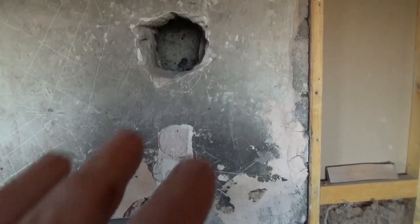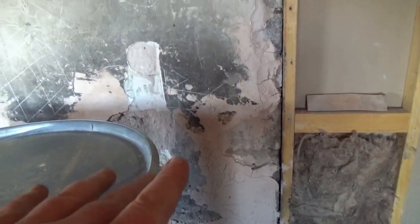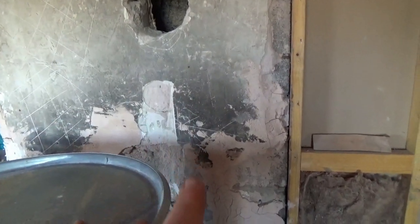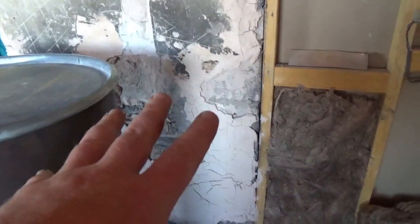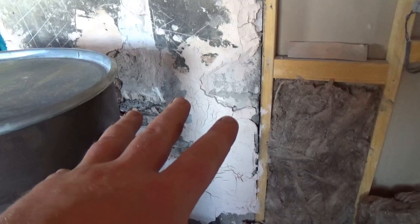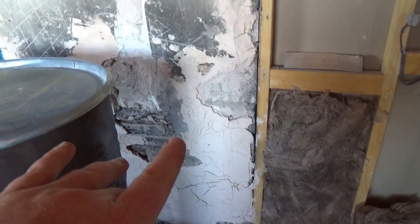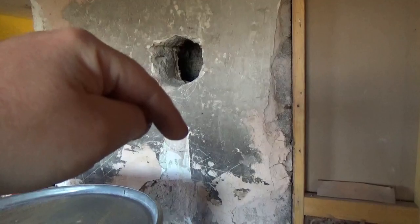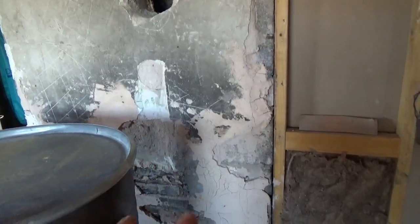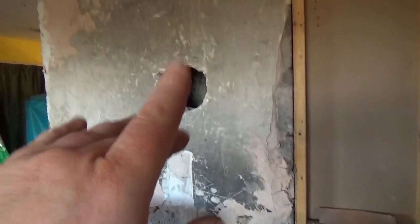If you watch the one about the ground prep and getting the foundation done, you'll know that the boiler has got to stay in place because this entire chimney breast had so much messing around with it lower down that it was becoming unstable and I really wasn't comfortable taking any more out. At the time I said that when I went through the chimney breast with a nice big hole, I was going to pour liquid cement down there and fill the entire back boiler — all the voids in it — with concrete and make the entire bottom section completely solid.